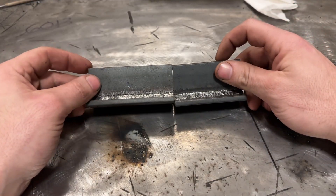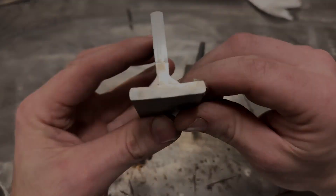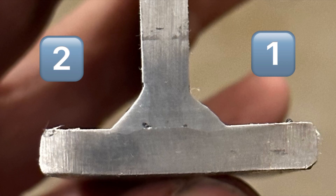The results are in and they're interesting. Grab yourself some popcorn and a beer — it's going to be over quick, but let's see what we can find. Pass one is on the right, ran at 130 amps. It's better than pass two and better than the previous testing in the rod shootout video, but it's not really anything to write home about. I find it kind of odd that it melted into the upright plate more than the bottom. Everything's centered at 45 degrees, but there's very little fusion in the bottom plate. There is some fusion in the root. That little dot on pass one isn't really concerning — that's just because the plate was not perfectly flat.